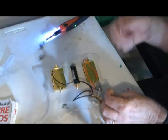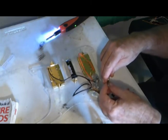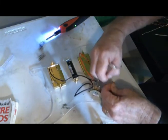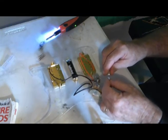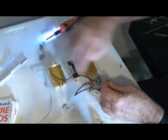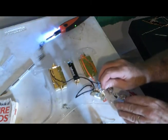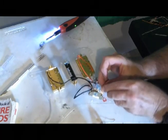I'm going to go ahead and cut that stuff off. But here's how I have to strip it. I can't use any pressure. I'm using my X-Acto knife because I can get more precision out of it than my stripper clip. I have to just lay it on there, no pressure at all, and then I roll the wire back and forth, and hopefully I cut the insulation without cutting the wire. Yeah, off screen I had a really fun time with some other wires for precisely that reason. So we'll twist it all together here, and now there's actually some wire that I can see, and I can go ahead and poke it through there and bend it over like that.